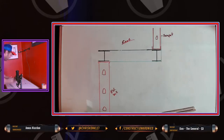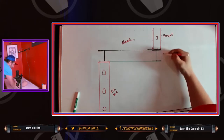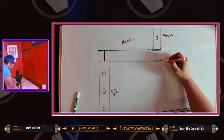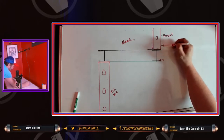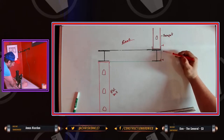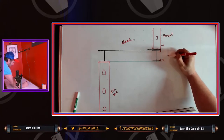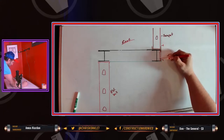Going backwards, you're gonna have to run an angle at the bottom and fasten this way, then catch it again up this way on the parapet. Very rarely, depending on how big the beam is, do you have to frame it out, but if you do, it's just angle and angle, and then you can use hat track in between for your studs going this way.